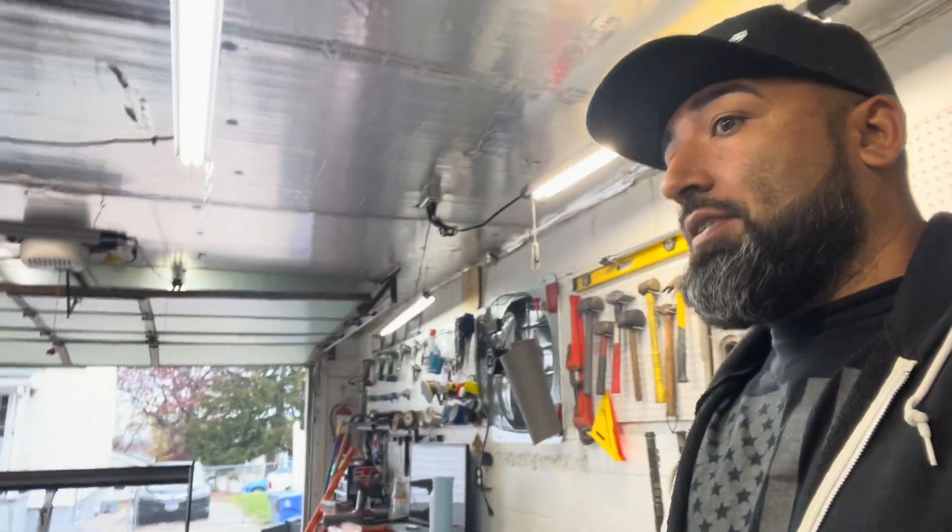It's been a couple days since I cut it. I just washed most of the dust off. I probably shouldn't have removed and cut it yet — should have gone straight into putting a thicker layer of epoxy on it, but you live and you learn. This is my third part, so I don't want to start over because it's expensive. When I demolded it from the hatch, right here I had some stress cracks in the resin. I went around and did a thick layer of epoxy around the edges — not super thick, but I wanted the edges to stick down really good. I started getting stress cracks here because it wasn't thick enough. All this area is still textured — you can see some of the stress cracks along here.